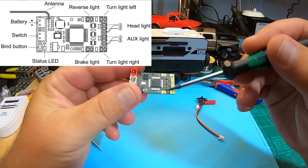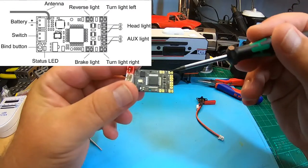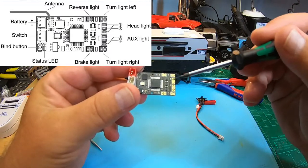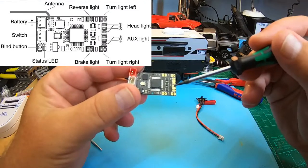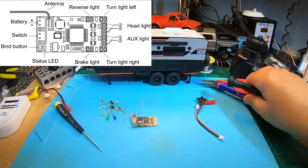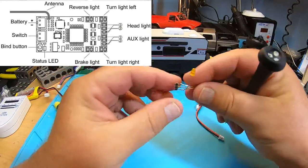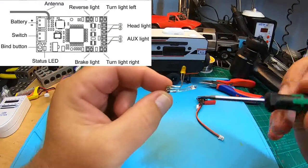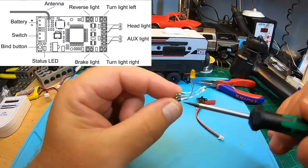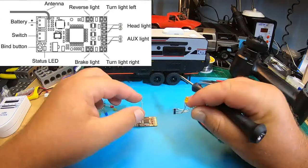I'll probably connect four turning lights — clear left and right. Orlando recommends yellow ones, so I'll use yellow, not orange. For the front beams, two different LED types with two plus and a common minus, and two different LEDs for auxiliary lights with a common minus and two plus. I prepared some 3mm LEDs to test the board — orange and white, each with a separate plus and common minus. Connecting orange in parallel with white will not work.